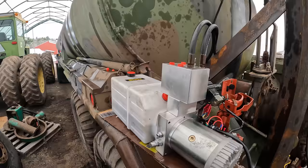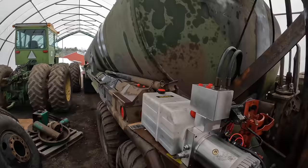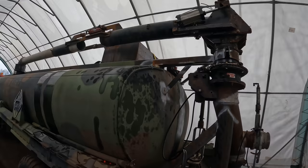There's not enough fluid in it right now - it's gotta be full because that's how you kill these things. It leaks out of the fittings because they're not actually the right fittings. So we got the fittings, we gotta get some hydraulic lines made up. We gotta figure out where it sits over there because we're gonna run one or two up to that cylinder we put on yesterday. We're gonna run two to the back spread, and we gotta lengthen the ones that actually run the rotate motor.